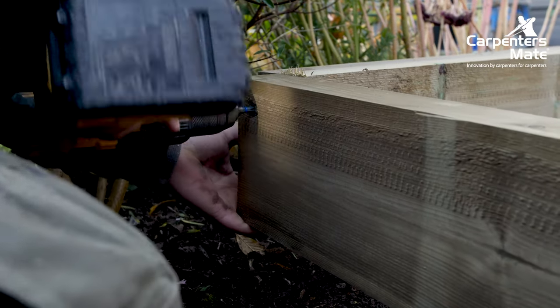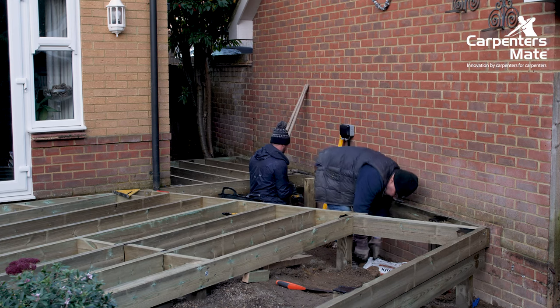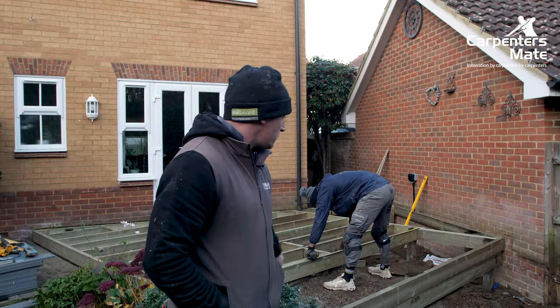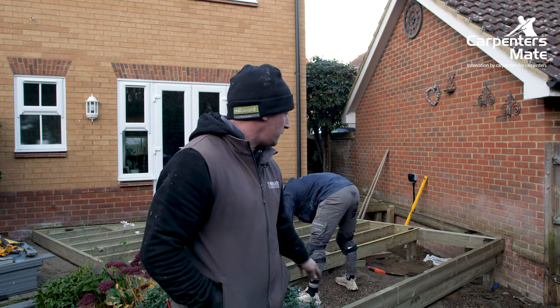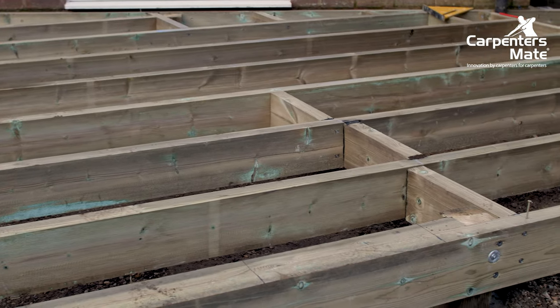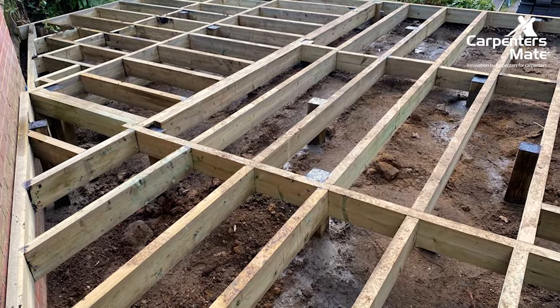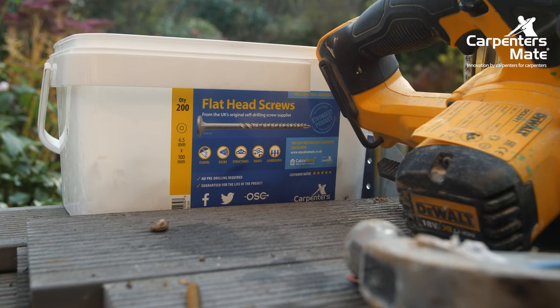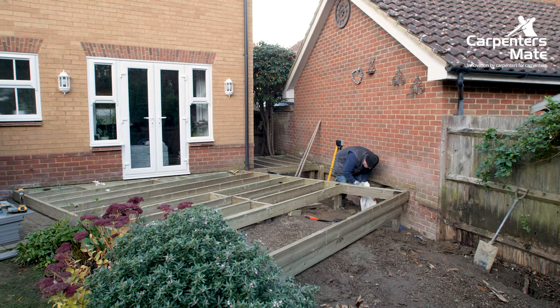So that's today done — we've just got to come down off of that second joist tomorrow. On the new area we've got a new step in using the same process we did around the corner. This area is going to be 150mm lower than the rest, and we need to put all the noggins and joists in the other direction to finish off this lower area, then we'll be all ready for the deck boards and the cuts. If you have any questions or comments please leave them below, and if you'd like to know about any of the products used, the links will be in the description. Thanks for watching — my name is Jake from Fairweather Garden Construction.